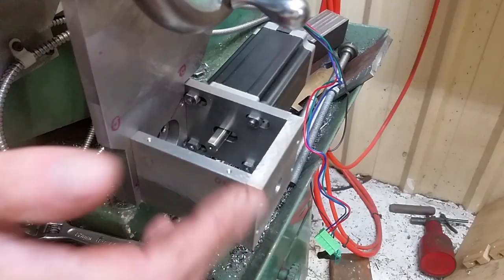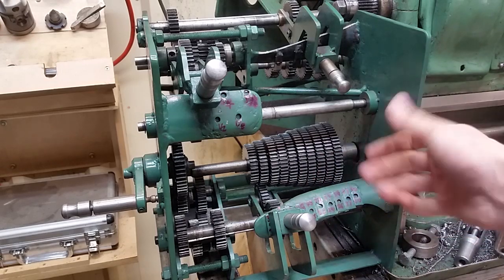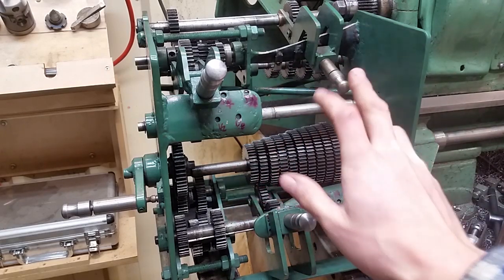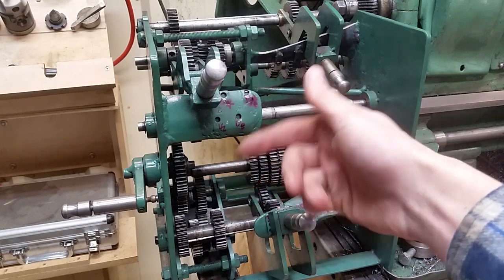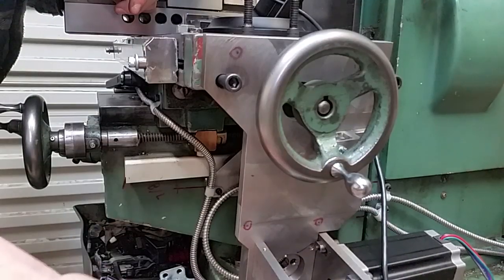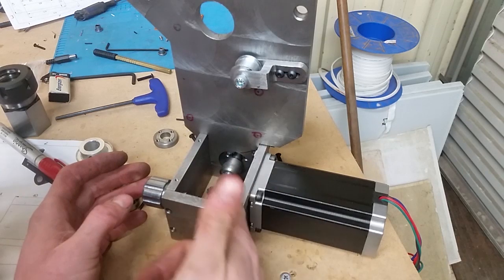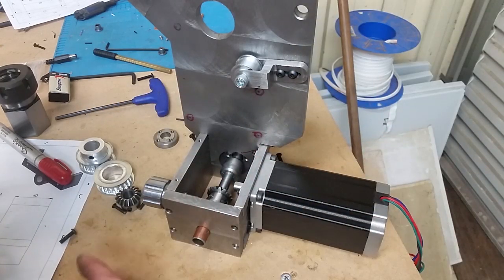Another question: why have I made this so solid and so thick? I've taken into account some lessons I learnt while building this gearbox. These plates are fairly thin for the size of this, so this was able to flex around a bit when I was building it — that's one of the reasons why I went with thicker plate. Another lesson from this is welding: once you start welding and things start warping and moving out of alignment, you more or less have to hand fit everything from there onwards. I want to just be able to pre-drill the other one with a bit of allowance but not mess around with hand fitting and aligning. This video is getting a bit long so I'm going to leave it here — I've made most of the components so the next video is not too far away. A few people asked and I think we'll do another video on coding, then we're going to get into the gearing and the mechanical side of this. Personal challenge to some of you out there — if you haven't subscribed, click the button now. Catch you later.